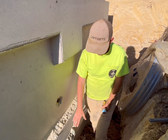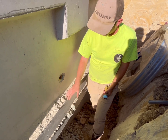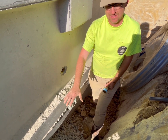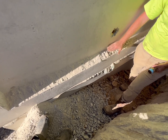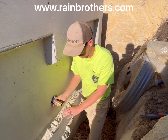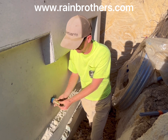We can stand in it comfortably to get this fitting in here, but we always make sure to bed this side of the tank — the pump end of the tank — with stone all the way up to and above the water line. That reduces the chance for settling, and if the ground settles over this water line, it can put pressure on that water line, push it down, and create a kink or separate it from the fitting.